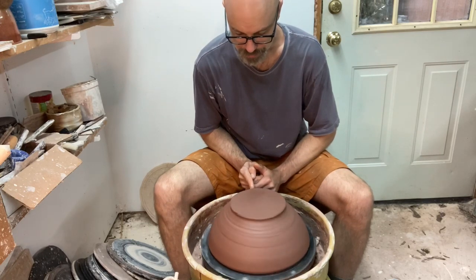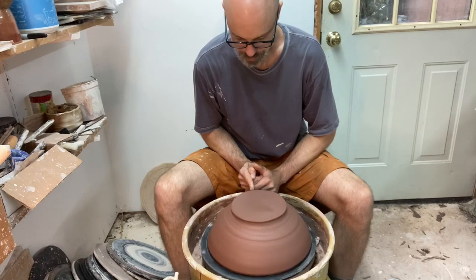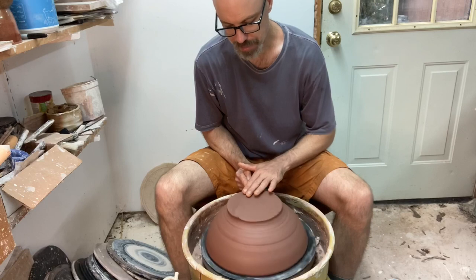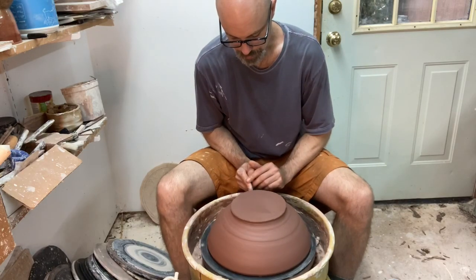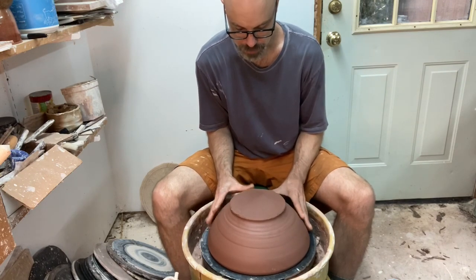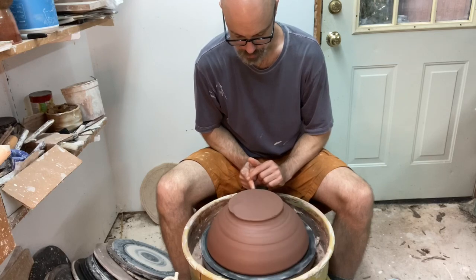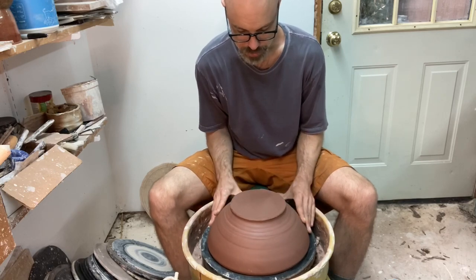You can see it wobbling left to right as the wheel goes around, and once per revolution it's going to come and touch my finger. I'm gauging down a little - not at the very bottom where I cut off, but maybe an inch or two down. When it touches my finger I'm going to stop it and push it away from where it was touching. It's closer, but still just touching once per revolution, so I'll stop it when it gets to my finger and give it a smaller shove.